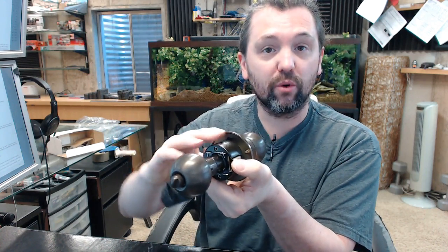Further definition of what cylindrical means doesn't matter — if your lock looks like this, we are going to call it cylindrical, with a retracting hub inside. With this sort of cylindrical lock, that latch bolt is going to only go in on one side of the body, and the latch can go either this way or that way. So the lock can either be a left hand reverse or a left hand lock. But if you need it on the other side, flipping it over gives you a right hand or a right hand reverse lock.